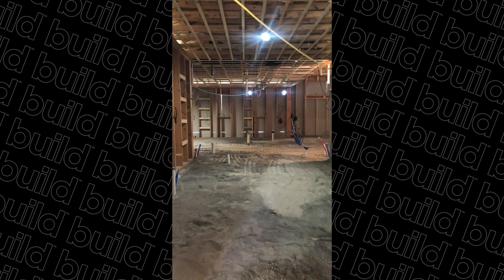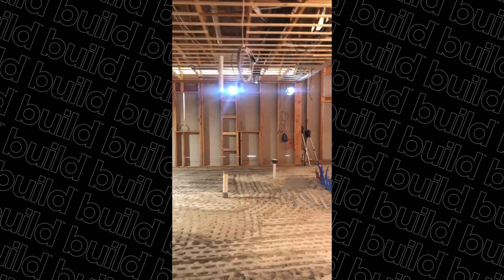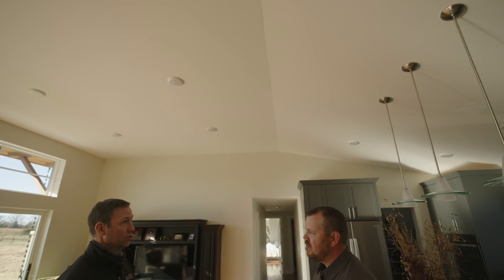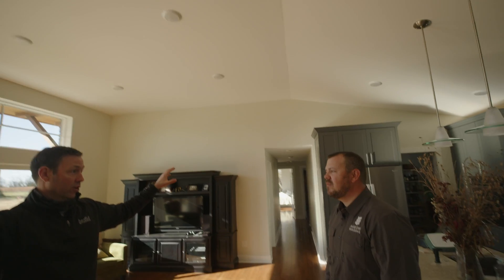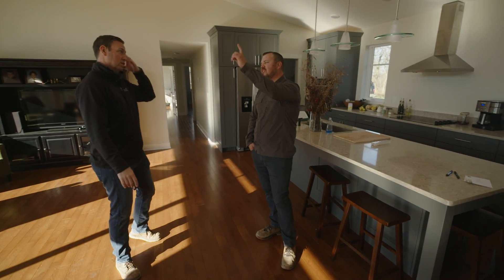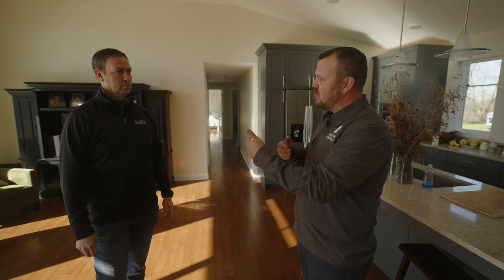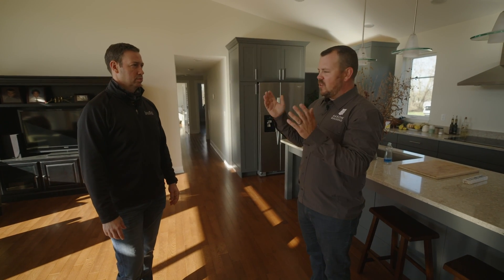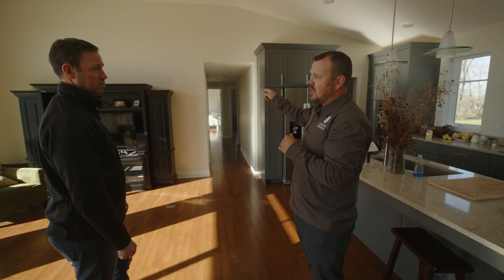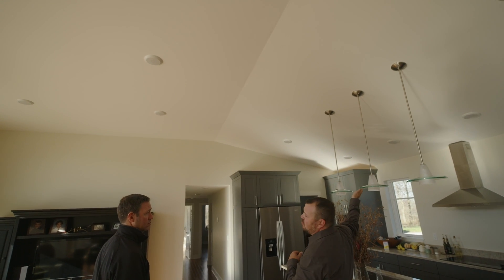Once the subfloor was down, it was still one big barn — no interior walls yet. Then we monolithically sheeted the ceiling with drywall: no partition walls in first, just ran all the sheetrock across the entire ceiling. The reasoning is we're using that as an air barrier. If you run it all beforehand and then stand your walls up underneath, you already have a full sheet. It also means all the butt joints in the bedrooms land over top of walls — there are no butt joints anywhere in this entire house.